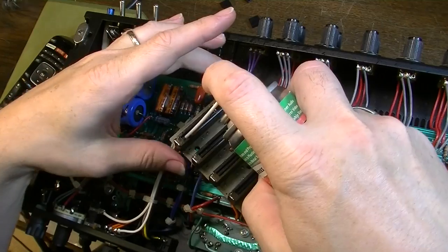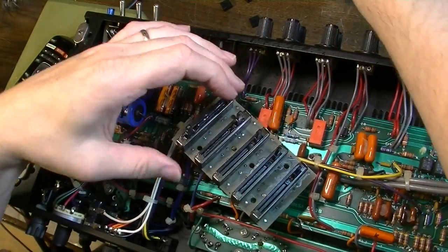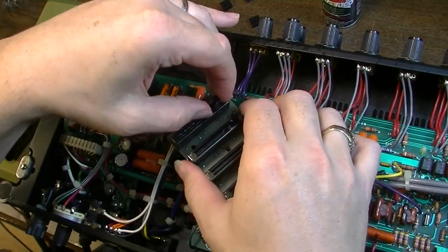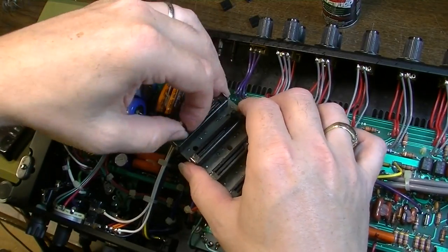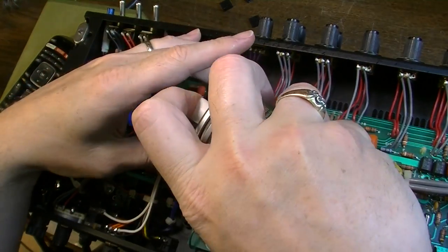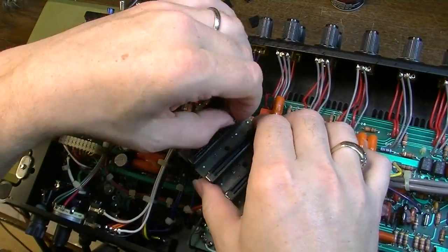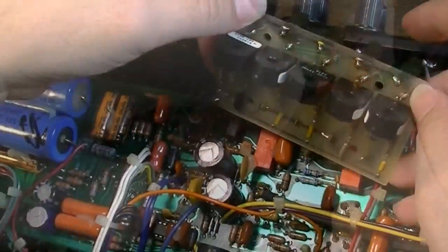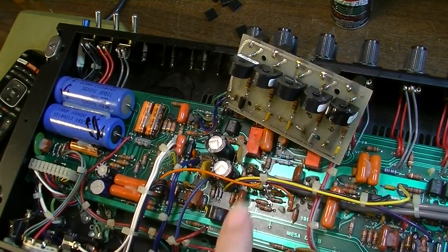But we can go ahead and we'll use some lube and cleaner, some actual DeoxIT fader F100 cleaner, and that should restore some lubricant in there. I'm gonna go ahead and reflow all the solder on this board, especially this one, because this one's definitely not making contact.